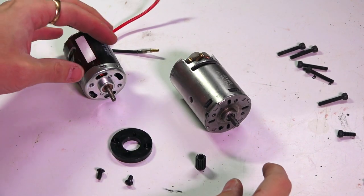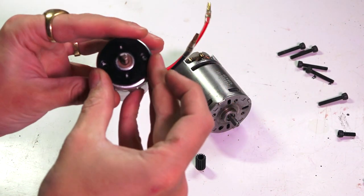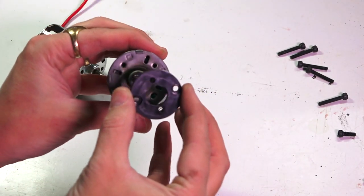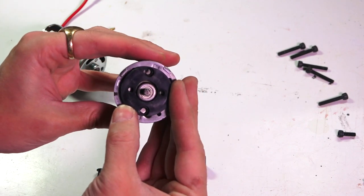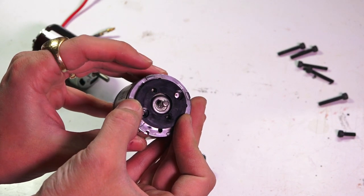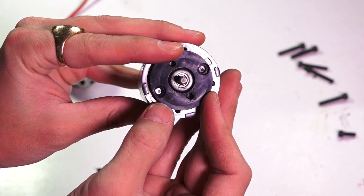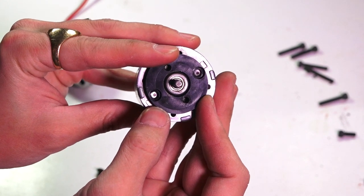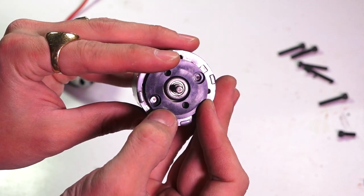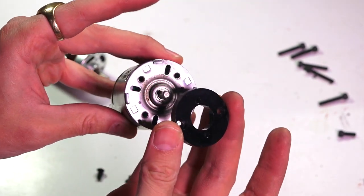Here are some things I hadn't considered when I ordered the DeWalts. The bolt pattern for the motor mount plate right here is perfect on these 750s, but of course when I'm getting to a bigger can, the holes didn't line up at all. It's not like I'm going to get another motor mount plate. So I put the plate here and I made sure I was close to the center as possible, because if I'm not on the inside center here, it's going to cause a bit of resistance or a hard point on the pinion. I want a good mesh. So I'm going to mark it, I'm going to drill it, I'm going to tap it, and hopefully I can get this motor mount on.